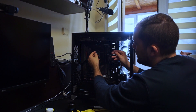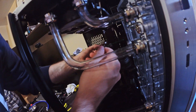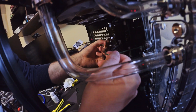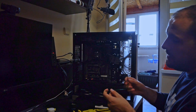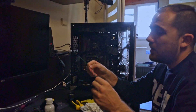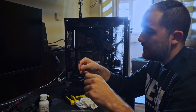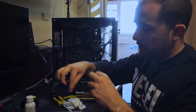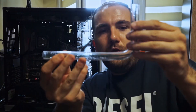I'm using the outer edge of each fitting. Going from edge to edge, you can see it's short — it doesn't go into the fitting properly. You use the wire because it is flexible and you can bend it at the point you like. This is the easiest method and it works surprisingly well, because sizing and cutting is the hardest part of doing hard tubing — this is where you start throwing away a lot of expensive tubing. When you're sure of the correct sizing and form, take the wire and place it on the already pre-bent tube, putting it in the middle of the tube. Mark the cut point with a non-permanent marker.